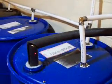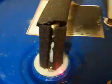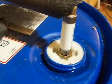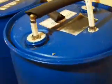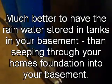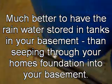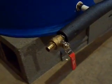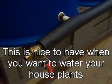So after the filter we're going to go into the barrel. I'm going through this hole right here — I'll take the insulation away — but we just tap right into that with the brass fitting. Down at the bottom we've got the outlet, and all the outlets are the same on all these barrels. This is a six barrel setup. At the end we have a purge valve in case you want to fill a bucket of water or just clean the system out.